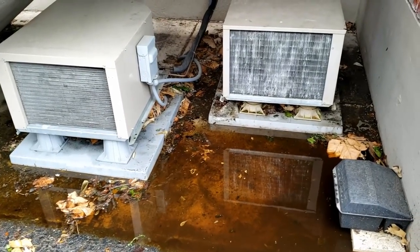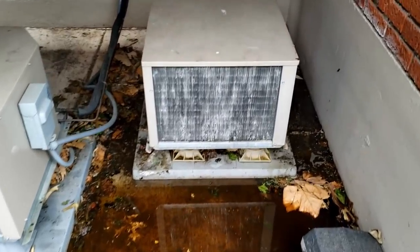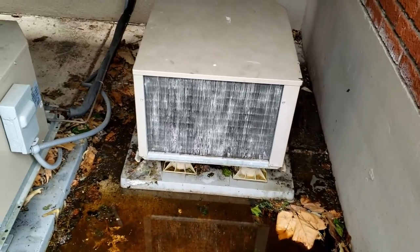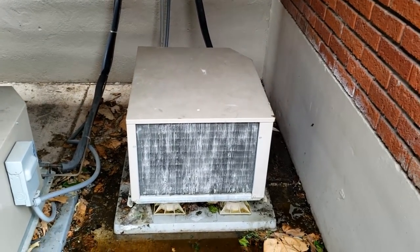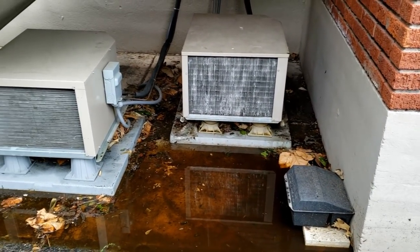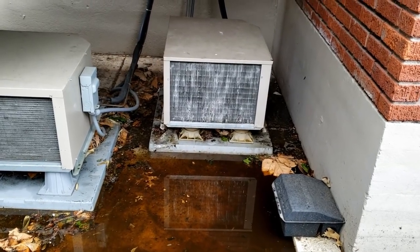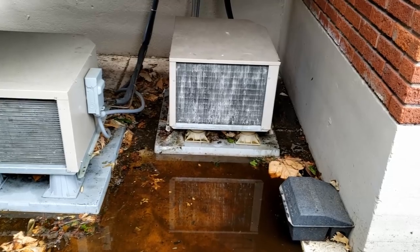All right, so she's satisfied and she's ready to go. The timer's set up. The coil looks a lot better than what it did. You can actually see some stuff getting through it. We've got the superheat set correctly. We were good out here on the superheat, because like I said, you're supposed to maintain that minimum of 20 according to Copeland. We got that. The line's not running as cold, so we're maybe going to fix his issue.